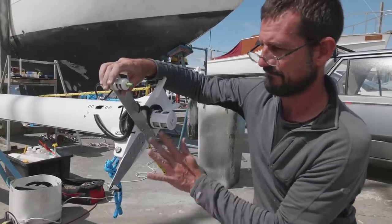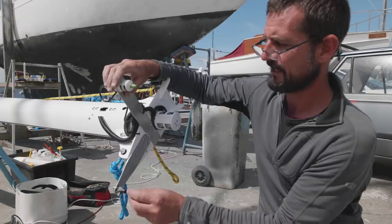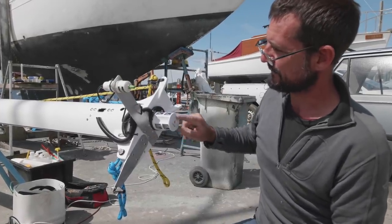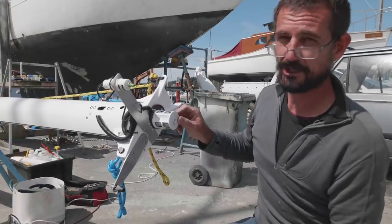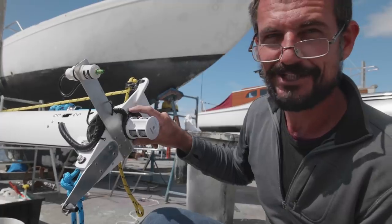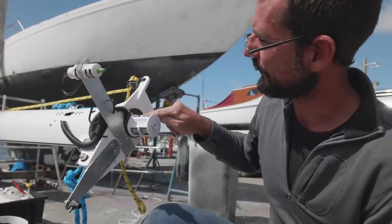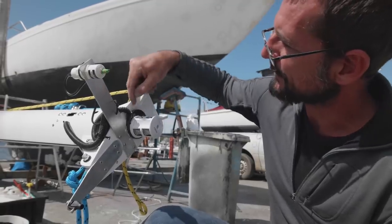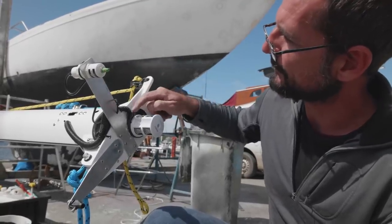So that's going to be further out in a little bit cleaner air and more visible from down below. And then this all contained, all round white light. This black disc, that's just a little custom donut I made up out of HDPE. So that's secured with 1/4-inch countersunk screws into the top. And underneath is a groove just to let the electrical cable come out.